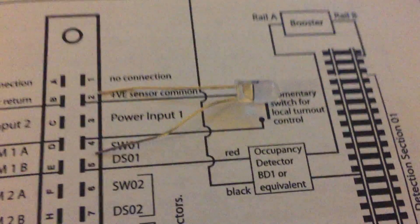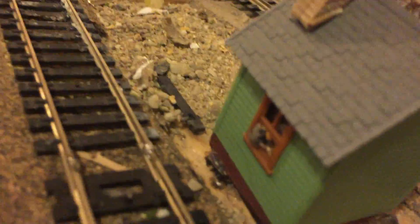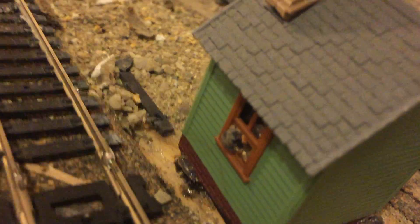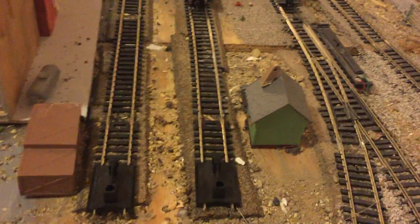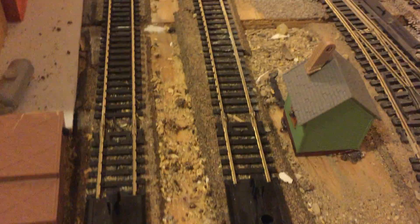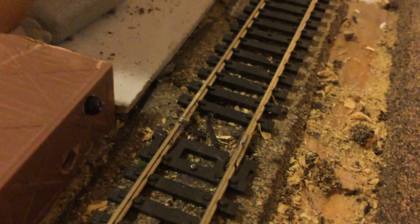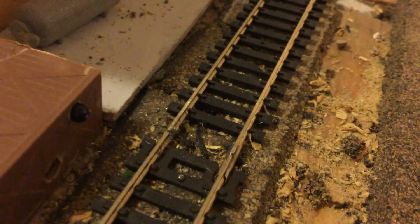So once that is installed, this is what you have. I've got these installed in here. There's the detector through that window there. The emitter is just sticking through there. So it's shooting across these two tracks here. The emitter is hooked up to 5 volts and a 33 ohm resistor to produce 150 milliamps.